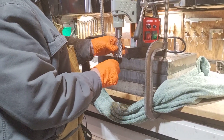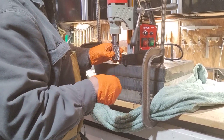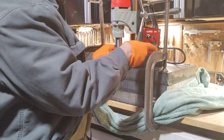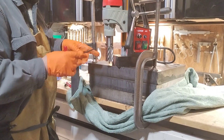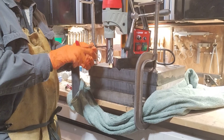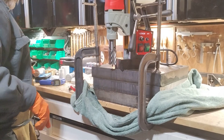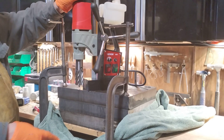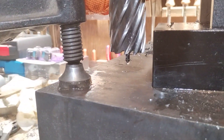You know, these two things we just had out — this is a good snug fit. You can feel that spring pushing back against you. When you tighten it, there shouldn't be any thread sticking out. If there are, the thing's probably not quite square in there or you're not on one of the flats on the annular cutter. I'm not putting it in there too tight. Now we can zoom in to this spot right here, thanks to my capable assistant.